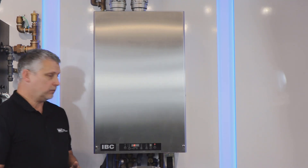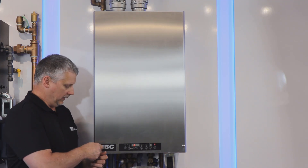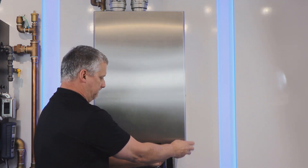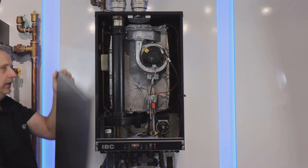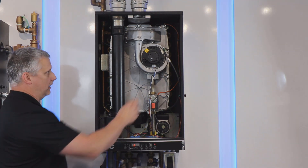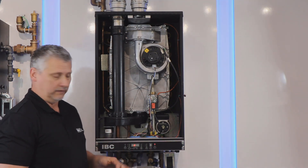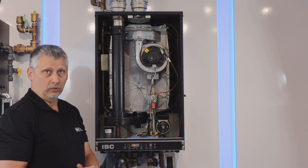In this case, we're going to show you a brief methodology to replace the blower and check the main board at the same time. Remove the screws on the cabinet to open up the front face and remove the cover. Once the cover is removed, go ahead and check the connections on the gas valve and verify that they're intact. You can reset the fault code at this time by pressing the far right reset button and try the blower motor again.